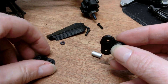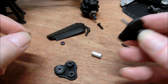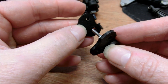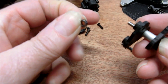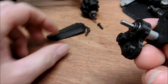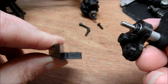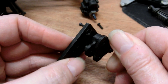You can see it's flat there and this one is raised. There's a bush — place the bush over the bolt and then place the other arm on the bolt. Take the spacer, place the spacer on the bolt, and then take the mounting plate that goes on the chassis, making sure that this right-angled side is away from you, and screw the bolt on to the plate.